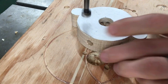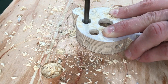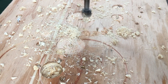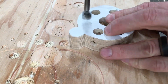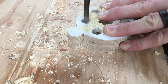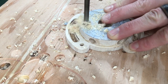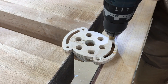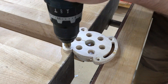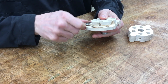Next, drill out the holes for the posts all the way around the body of both the switch and the glued-up mount and base. My template looks a bit odd here because I had to re-edit it - yours will have all the circle center points marked clearly. Then I put some countersinks on the holes in the mount, and it's time to put the magnets in and the steel posts to finish it off.